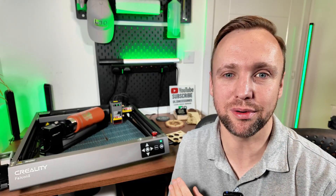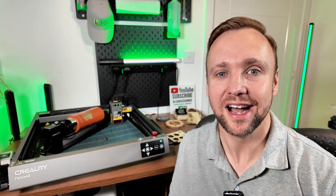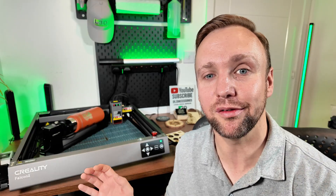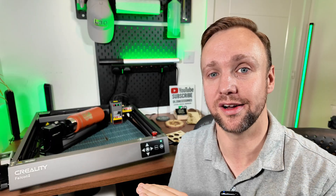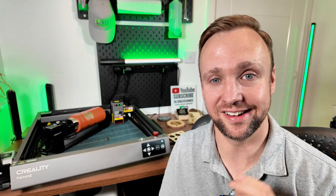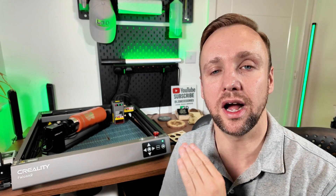I love the fact that this came pre-assembled. You literally just take a couple of items out of the box, screw a few feet on, plug in the air assist, and you are good to go — which is a massive pro for anyone who is not so confident with building things. The integrated air assist is also very good. I've used a lot of air assist on different lasers and this particular one was a top performer. I could noticeably see the difference in cut quality and cut efficiency. On the side of the machine there is a knob which allows you to adjust the power and intensity, which is really good — you don't see that very often. Usually it's either on or off, so the fact that you can define it down to that level gives you a lot of versatility.